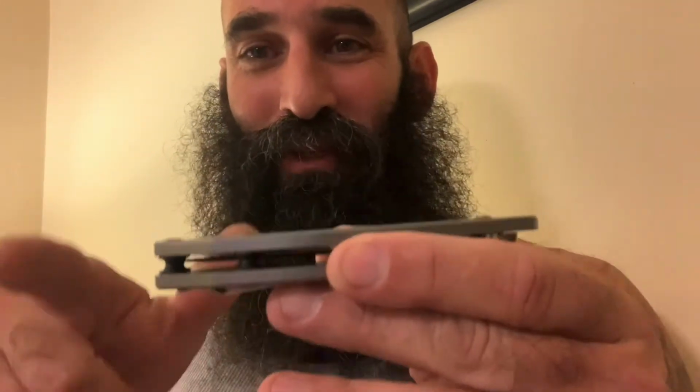Okay, so basically I laid it into a vise, and once it was flat, I wanted to deck it nice and smooth. The material thickness is 180 thousandths on that ZT, so I decked it. Let me get the knife again real quick. And if you don't know machining, that probably makes no sense to you, so I get it if you don't want to watch it. So I basically just milled it flat on both sides, 180 thousandths.